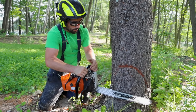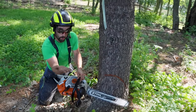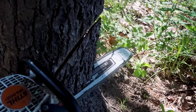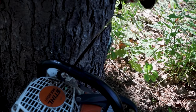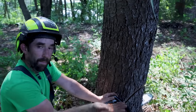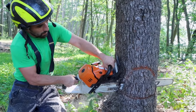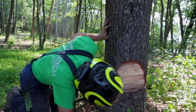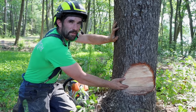I'm going to line this part up and put my saw here, aiming for the other side. As I'm coming through, I'm going to look through my top cut until my bar gets where I want it to be, so I don't go past that and have to make another top cut. When my bar comes right into that cut, that's when you know to stop. Now I have a nice 90-degree face. Going in about a chain width — a quarter to three-eighths of an inch — is totally fine.